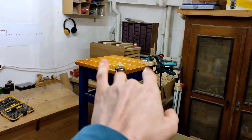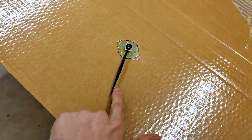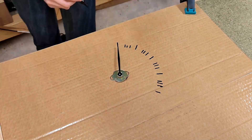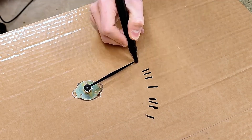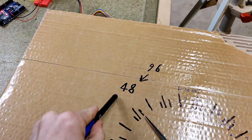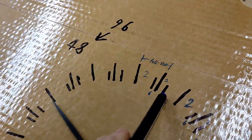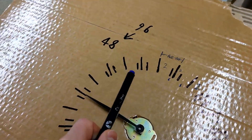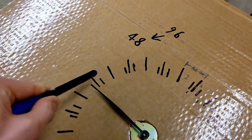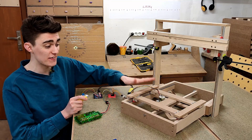To test our crappy motors, we don't need fancy lasers. I simply stuck it in a piece of cardboard and taped the minute hand of a clock to the pinion, and I'm going to draw a line whenever it does a step. This one had me puzzled for a bit — at first glance it looked like it was doing the same thing as the other one, but then I realized it's only actually doing 48 out of 96 microsteps total, even though I had changed nothing on the stepper motor driver. One full step goes from here to here, and it's always grouping the first three microsteps into a single jump and then doing the last one to the next full step position. All the smaller increments are always grouped around every other anchor point, rather than every step showing the same pattern. That is extremely fascinating, and it's all down to how these motors are manufactured.